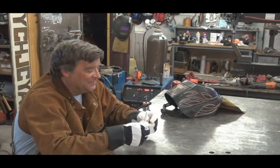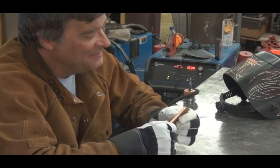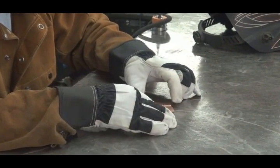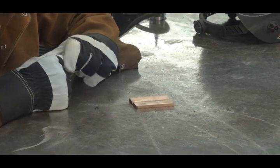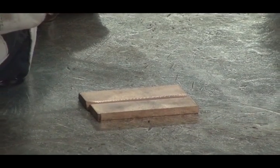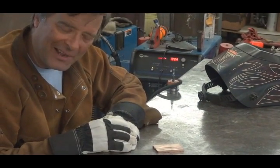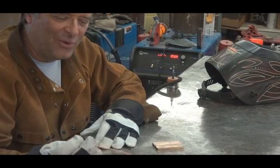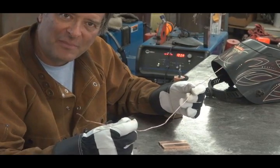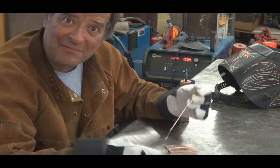So this is just a little piece of quarter-inch thick copper plate that I had left over from a different project. I cut off a couple little pieces, chamfered the edges so we get a nice weld in there, and I thought I'd just put them together and run a little bead. Now, most of the time you run down to the welding store and get the proper rod, but because this is just for fun — this is scrap going right back in the scrap bucket — what I found works well with copper is actually a piece of Romex electrical wire. I had some left over from remodeling the studio, so I just stripped it out. It works just fine for what I'm doing here.